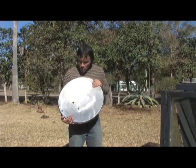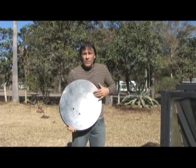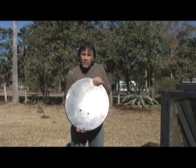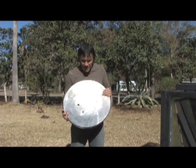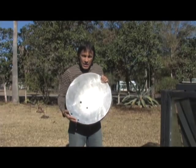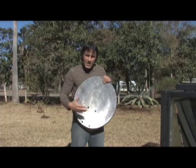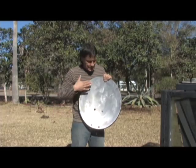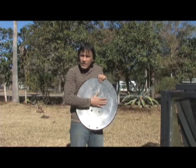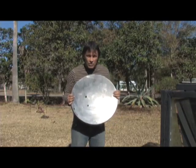What I've done is I've taken one and sanded it down to the bare metal. I used 200-grit paper for the finish and you can see it's got a kind of shiny surface — this is about equivalent to what aluminum foil would give you. The problem is, in order to get this down to a usable mirror, you'd need a cotton buffer on a bench grinder and the proper paste to get it really smooth. To get it to be a mirror takes a lot of work and expertise.